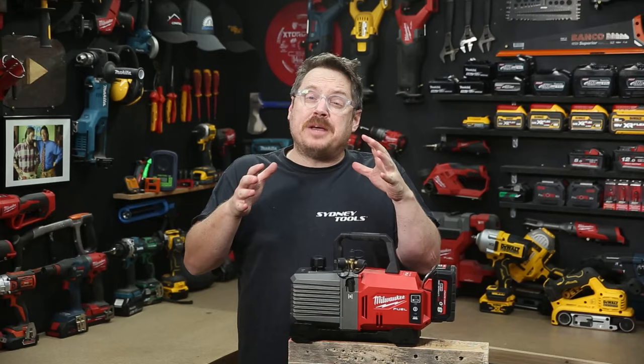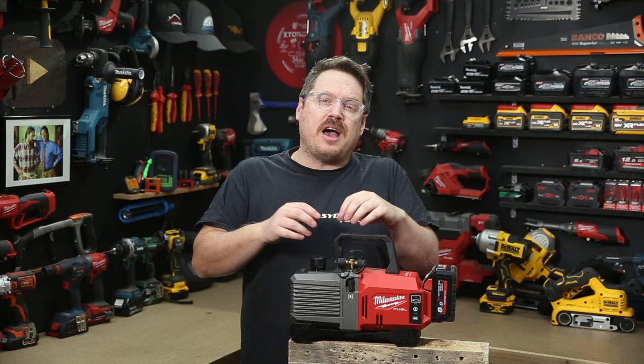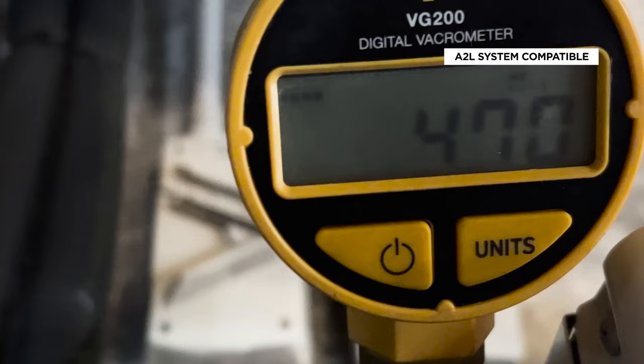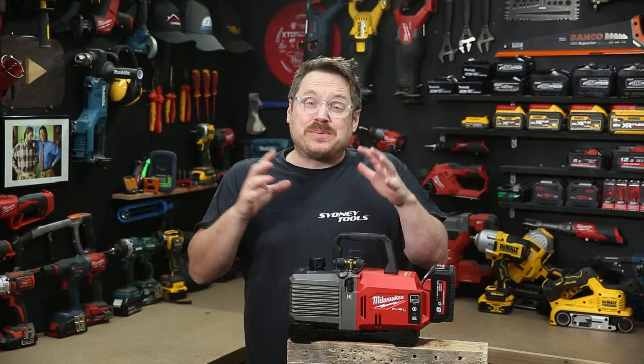Now there were no GPOs on the entire floor, but thanks to this being cordless, we can still vacate that 30 metre run all the way from 55,000 microns down to just below 500 microns in less than 30 minutes. And that's where this really shines — the fact that it's cordless.